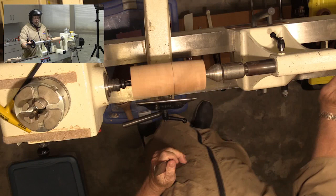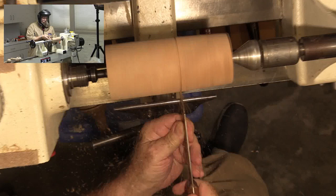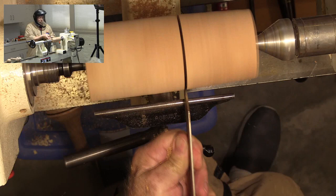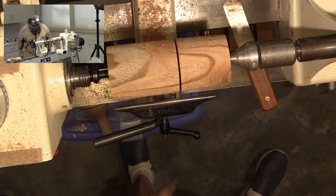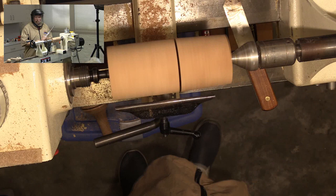For those of you who haven't used a thin parting tool — you can't just put it straight in, you have to wiggle it. You need to aim up and aim down; that gives it room. If you just put it straight in, it will grab and catch. So you leave something about an inch, three-quarters of an inch, just to start off the stem, and now I'm going to turn this part away.